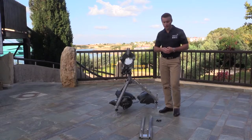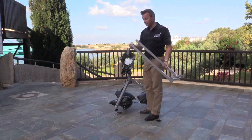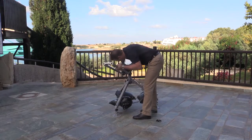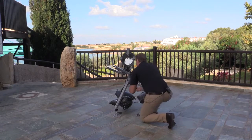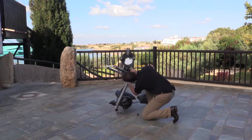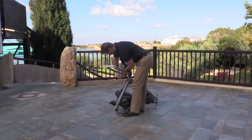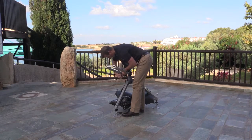The next step is to place the feed boom in position. For that you need the feed boom assembly itself and four of the wing nuts. There's a little bit of a trick with getting the feed boom on — you'll notice there are a couple of keying recesses on the bottom, and you need to make sure they're received right at the base of the unit and slid right into place so that you'll be able to get the wing nuts done up. At this point we can tighten these right up.